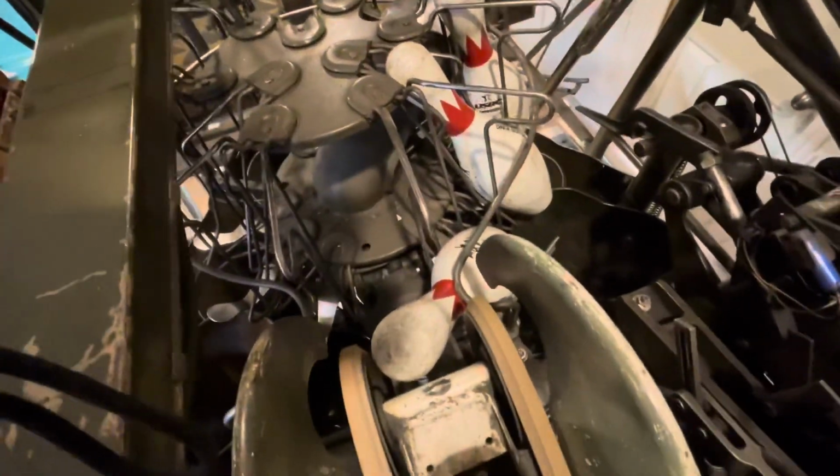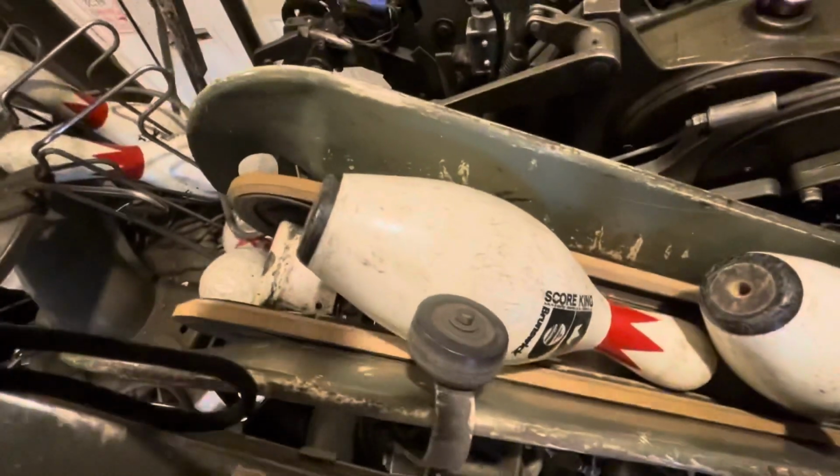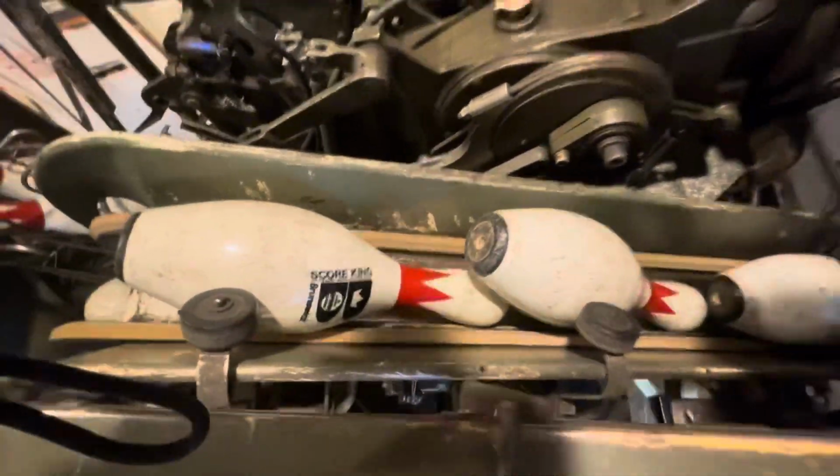In this situation, the pin failed to go into the turret wires properly, so it's now keeping the turret from indexing to the next position, and the pin gate will not unlock. Lift up both rollers, pinwheel will stop feeding pins.